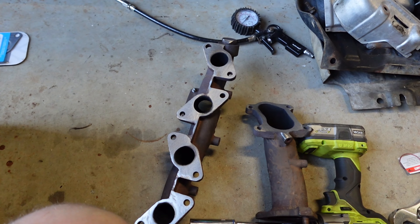What I'll do after that is get the right angle — it's hard where it is. Use the same thing, drop the right line. As you can see there, I've got a straight line, and right there is where I'm going to drill it. So I'll go through and do all 16 of them. We're going to set it up on the drill press, start with the 3mm drill bit, go through and do all 16, then step it up to a 6mm drill bit. Oversizing it by a mil will give me 1mm of play around the screw — so in case I'm not completely square. Account for my error, basically.